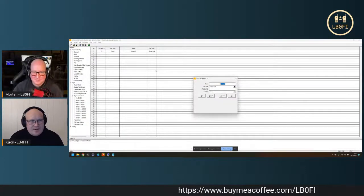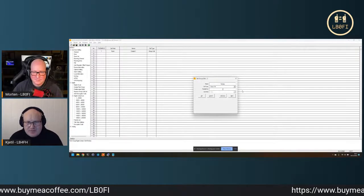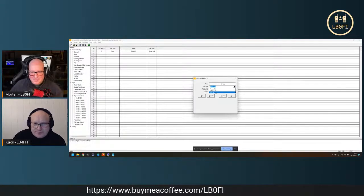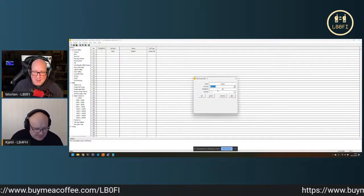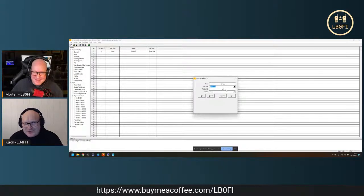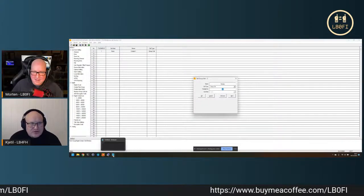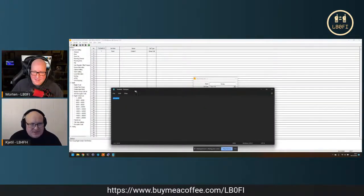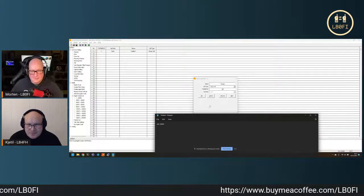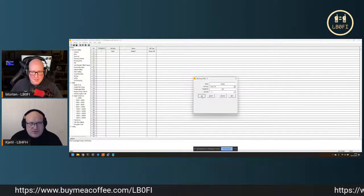So in here, just double click and you can enter a name. For example, Norway, and say that's DMR ID 242. This is a group call. You can do a whole call. That's pretty much the same thing as I was showing, except that when you do it, it shows up. And for those who are new to DMR, 242 is the prefix for Norway. So you can see my caller ID is 242-3049. Everything in Norway starts with 242, and same for other countries. So 242 says it's Norway and the main talk group.